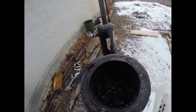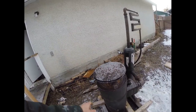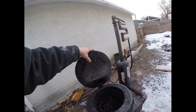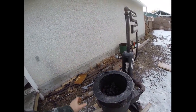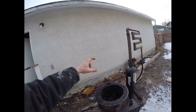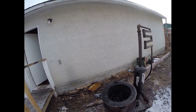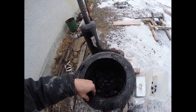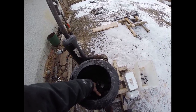Eventually I want to build a hopper off of here, because one thing that happens is condensate will catch on the top and inside your vessel. What you want is a hopper with a double wall and a screen so that all your condensate drops to the outside and you can drain it out. For now this seems to be working okay — I've got about 12 hours of run time into this system so far.